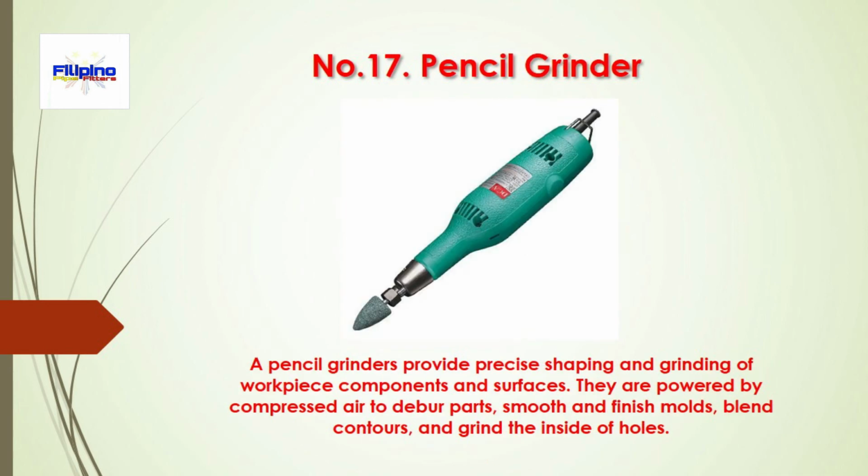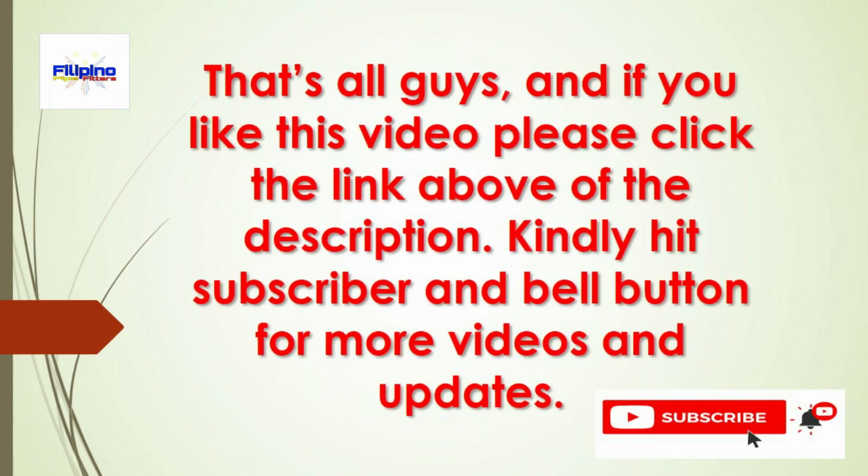Number 17. Pencil grinder. Pencil grinders provide precise shaping and grinding of workpiece components and surfaces. They are powered by compressed air to deburr parts, smooth and finish molds, blend contours, and grind the inside of holes.